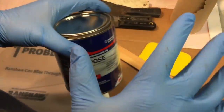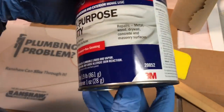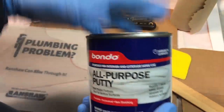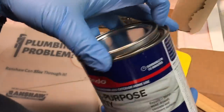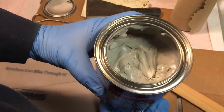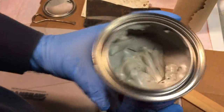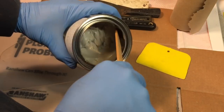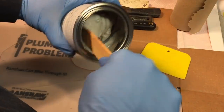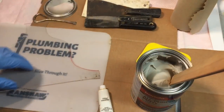Always a good idea to put on a pair of gloves if you're working with this, and also have a well-ventilated area because it could smell a little bit. Unfortunately my product here is drying out a little bit — I'm going to use a little bit and then get a new can. When you open up the can, it should be a little more liquidy, a better viscosity than this. The first thing you're going to do is mix up the Bondo from the bottom up and get it mixed up before you put it onto your plate.